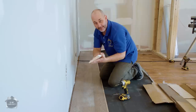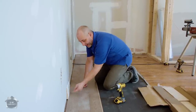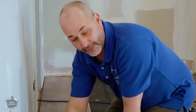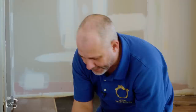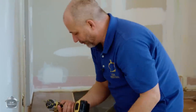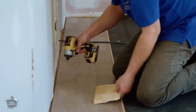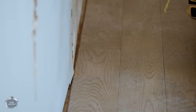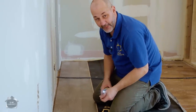Make sure you paint your baseboards before you install them. Then you can brad nail way up high and just do touch-ups — you never have to use a brush down by the flooring. To keep everything square while you build the rest of the floor, take a drill and put in a couple of screws where you're nice and tight to the wall so nothing's moving around on you.